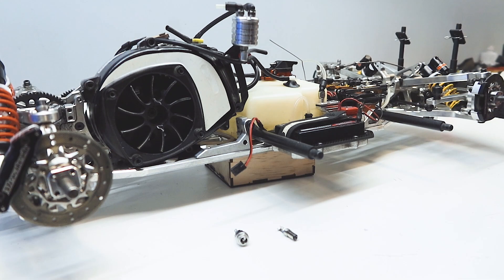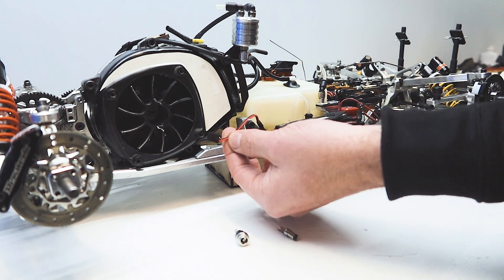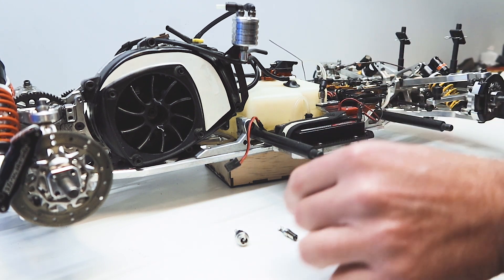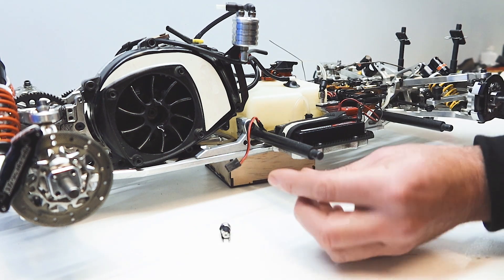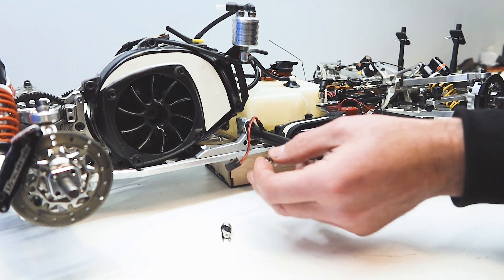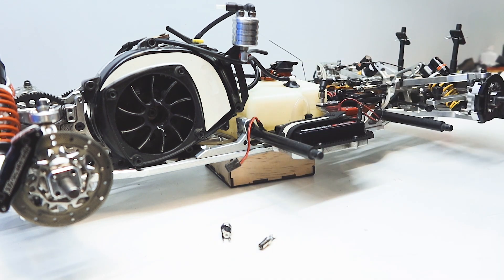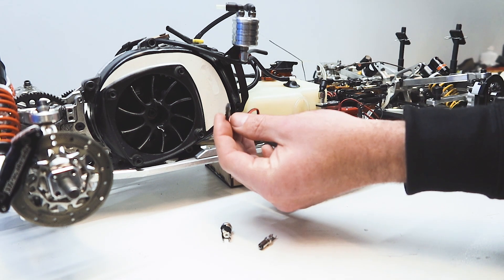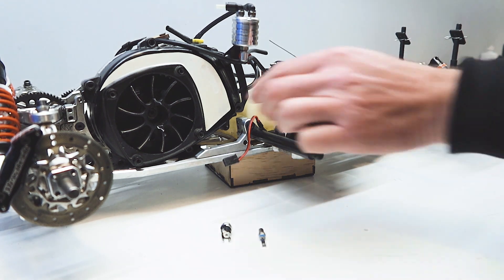Right now I've got just this wire here that runs through some braid to the receiver box. I'm going to mount one of these 5.5mm power connectors into the side of the fan cover and solder on a male connector to this wire. I'll show you how to do that. It'll make life so much easier just to unplug and plug that in. The servo connector pins I've been worried about because they are quite small, whereas there's a much larger contact patch with these power connectors.